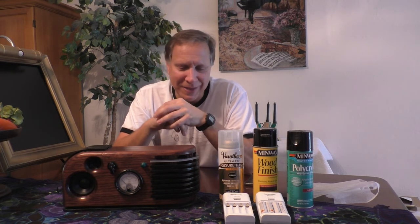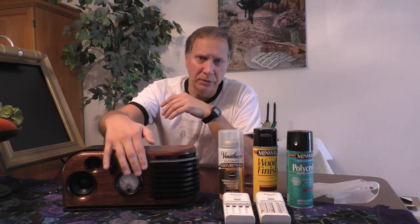The little light bulb, 200 milliamps. So yeah, using a 200 milliamp bulb in there would have literally halved my battery life. It drew more than the entire rest of the thing put together. So I actually considered it because I liked it so much. I thought, well, 6 hour battery life, that's not too bad, but I couldn't give up that much power. So reluctantly I put an LED inside of the bulb, inside of the little green diffuser thing.